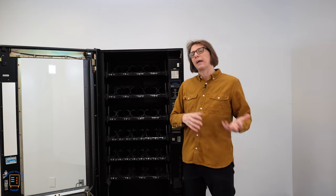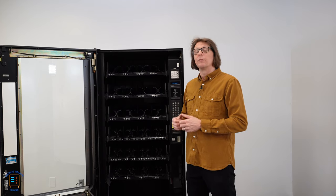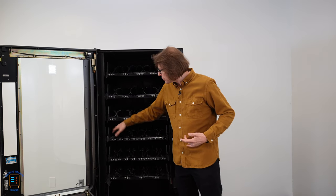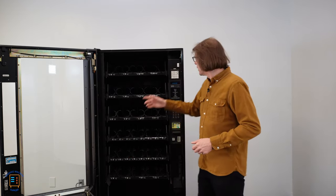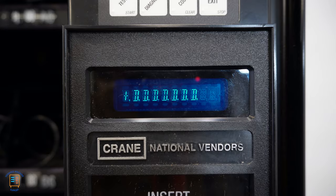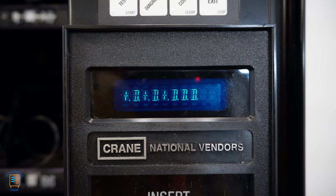This will also eliminate the D1 motor — the customer cannot press D1 anymore because it's no longer going to be utilized. So if we're going to marry these two selections together, we'll want to remove the D1 selection label. To marry additional selections: press 2 for D2 and D3, press 4 for D4 and D5, and press 6 for D6 and D7, because that is always the even numbered selection of the union.